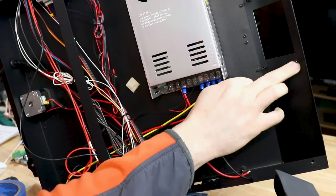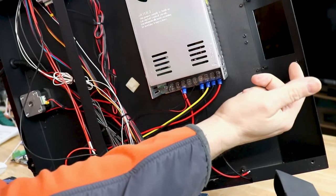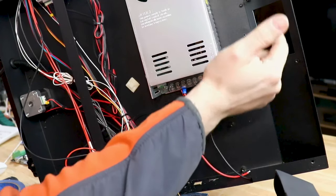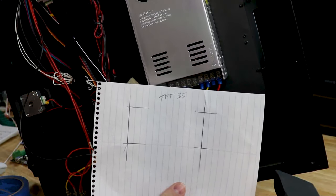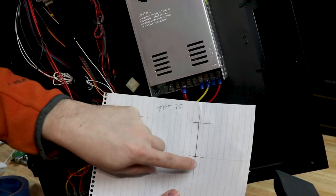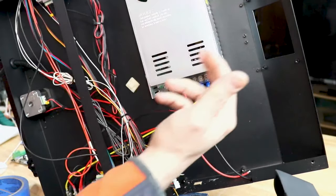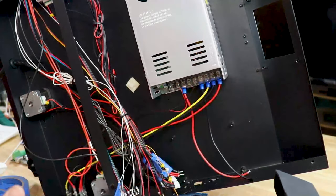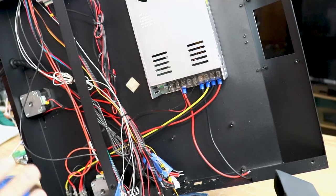Now, I don't know how this machine was made. On the front, there are little divots. So I'm hoping that when I cut these, they don't fall out. So we'll see. If everything goes smoothly, it's a matter of cutting these guys out and then using the schematic drawing I have, showing exactly where the corners are and where the holes are. So I'll punch and then very slightly drill holes to the outside, and the screws would come in from the front to hold that guy in. And I have standoffs if I wind up needing them too. If it's too close, I have some nylon standoffs, and we can accommodate there.